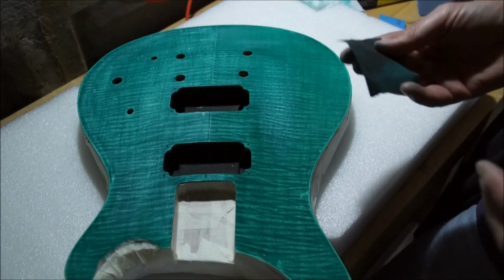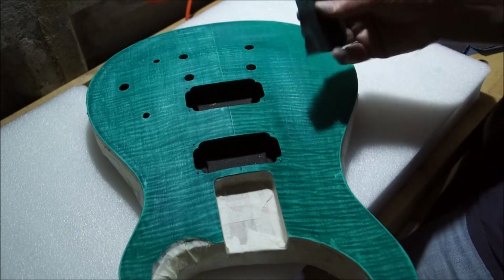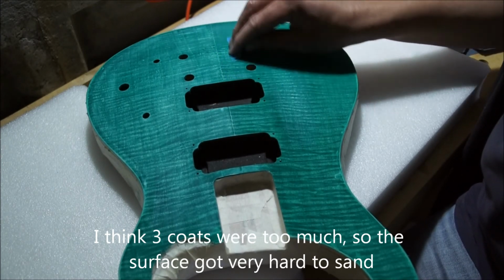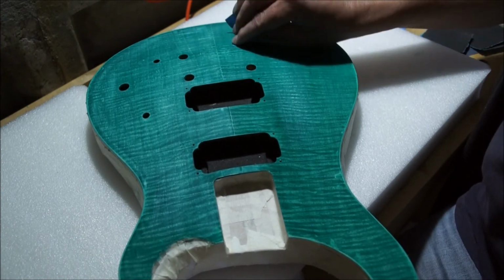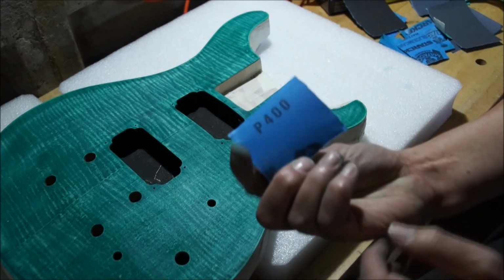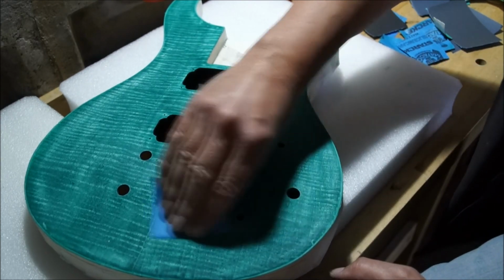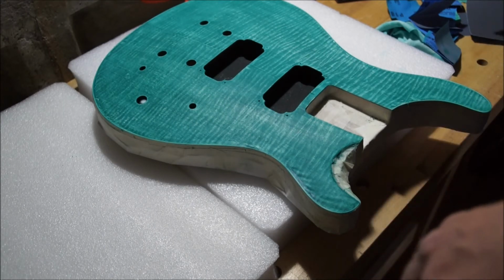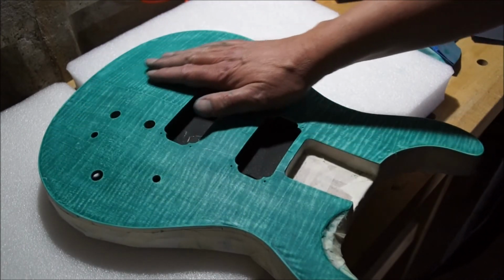Okay, I'm continuing to do this sanding down, and I think I'm needing this rougher sandpaper. This is 180. Okay, we're now going to have a go with 400 grit. So, let's see how we get on. Okay, well, I think I've finished the sanding now. I've just finished with a final rub all over the surface with 1000 grit. And it's lovely and smooth everywhere.